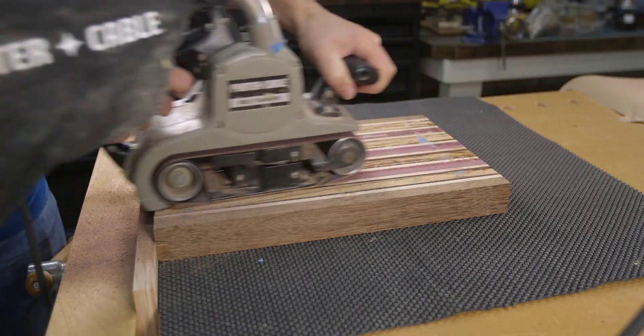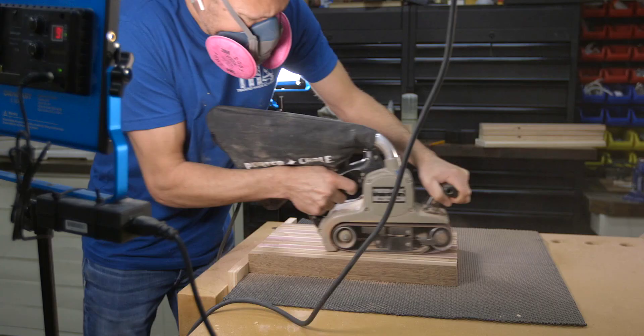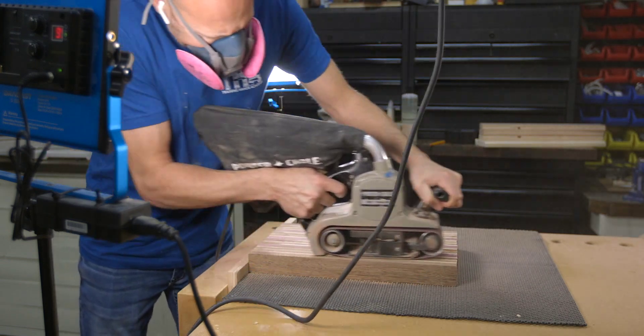However, with all that said, nothing beats the protection that can come from a powered respirator. So which one is right for you? If you're a weekend woodworker or do a lot of small projects, a negative pressure mask with P100 filters works extremely well — just make sure it fits your face really tight. However, if you've got a big beard, wear glasses, or you're in an extremely dusty environment, a positive pressure mask might be worth the investment.